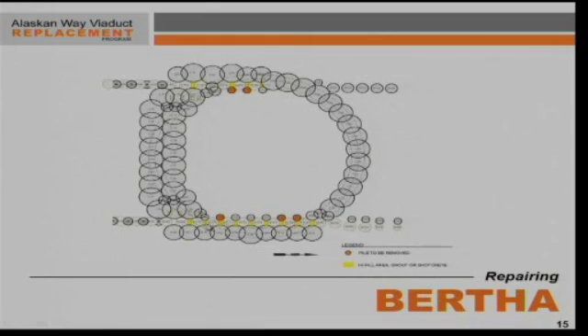This original wall here, with the yellow spaces in between, was part of the contractor's advanced underground settlement mitigation wall. That was constructed and installed by the contractor before they began mining, to provide a measure of separation between the tunnel boring and the foundations of the viaduct next to it, because the tunnel wasn't very deep yet.